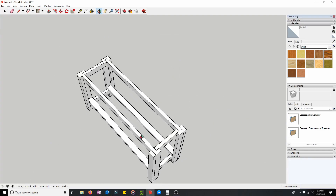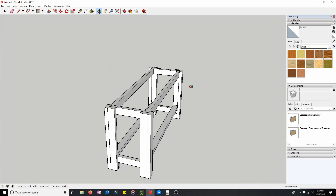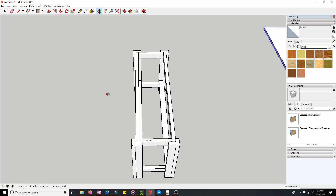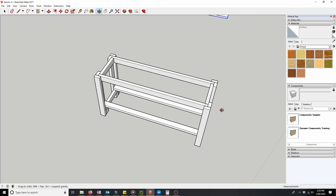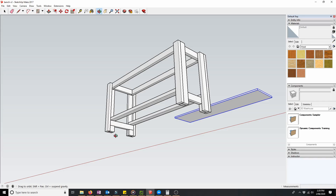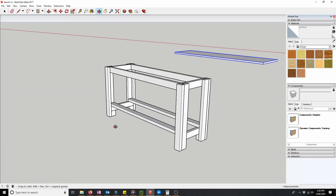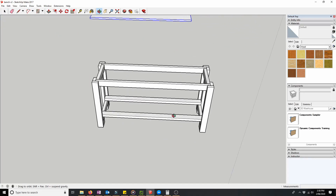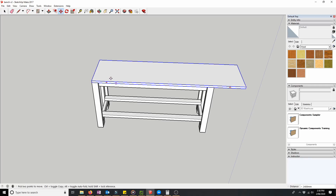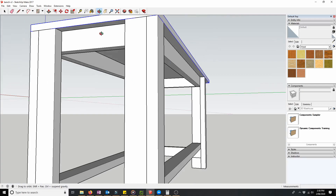As you can see, the legs are made up in an L-shape, which I've seen work very well and a lot of people use in different designs. That seems fairly sturdy. Then we've got the top aprons here which join on the inside, and then the top and bottom rails — same size. At the bottom of the bottom rail there are little blocks for a bit of extra firmness, stability, and strength. Then we've put in some bottom stretchers just to help with racking and keep it a bit more stable. Underneath the sides and at the back there's a little lip created, which will be quite handy when I want to use clamps.